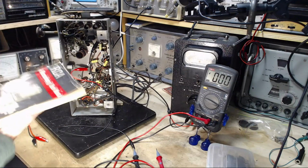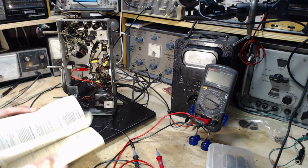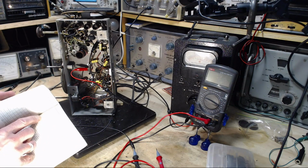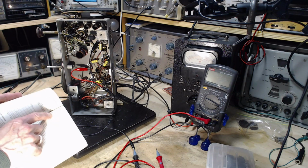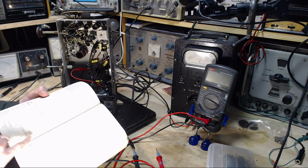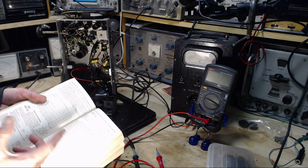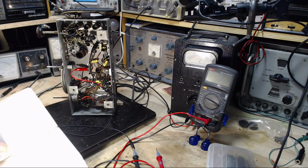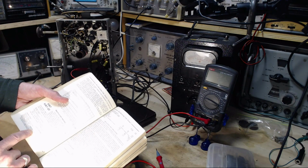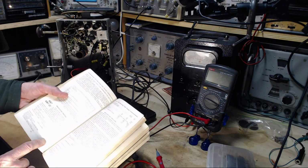This time I'm going to use my manual to look at the 6SK7. Grid number 1 voltage, -1, -3. Those are the kinds of biases, but isn't this thing driven by the AVC? Remote cutoff pentode. I'm sure it's driven by AVC, but I guess it has a kind of landing bias or a base bias or something. Grid number 1, positive bias value. What is that? Grid number 1, control grid voltage, positive bias value 0 max.